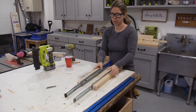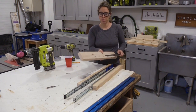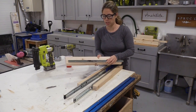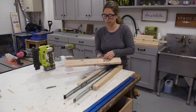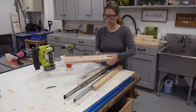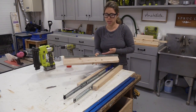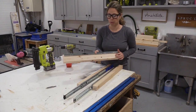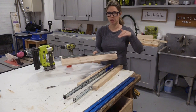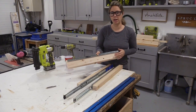Now I'm going to work on the center piece. This will go in the middle with the inner part of the drawer slide on each side. I want to mount it so it hangs down — plenty of room for the pots and pans and organizer hooks to go in there. So I'm going to mount this at the top of the 2x4. The main thing is that drawer slides will bind if you don't mount everything exactly level, so I'm using my flat surface as a guide.